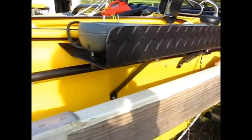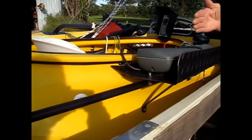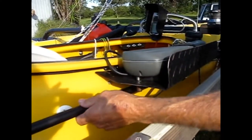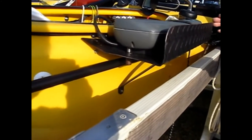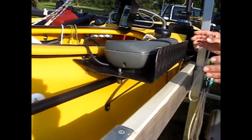Now all I have to do is get it on the water and see if it works in reality. It might not, because I have it orientated aft rather than athwartship, where it is supposed to be on other boats. Whether or not the flux gate compass in here is going to work when this is orientated 90 degrees out of position, I will have to wait and see. Thank you. Later, sea trials proved it to be successful.